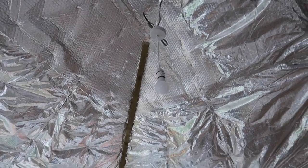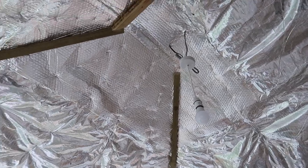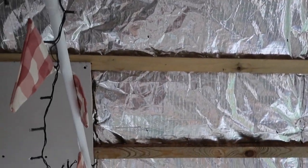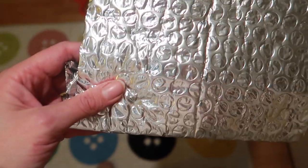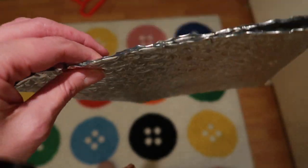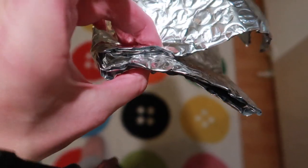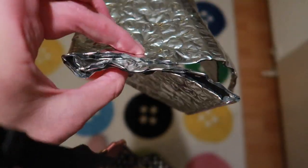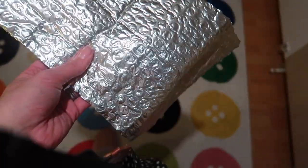The temporary light is just so I can work in here with some light — it does work. Eventually when I've finished the plasterboard I want to put a proper ceiling light in. This was the bubble-wrap-style insulation material I used to cover that patch in the middle where I didn't have enough Super Quilt. I ordered it from Amazon — it's quite thin on its own, so I quadrupled it over and stapled it into the gap, then taped up all the seams.